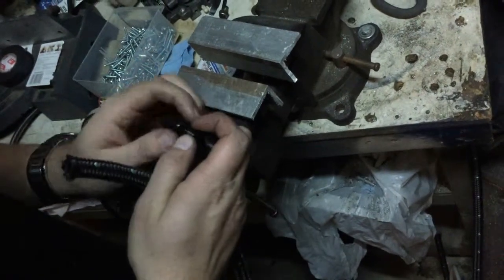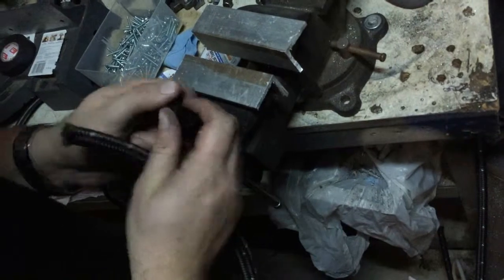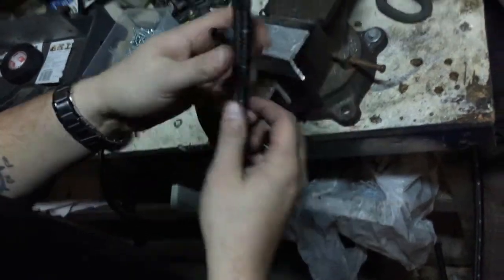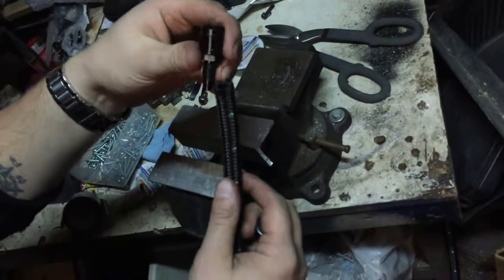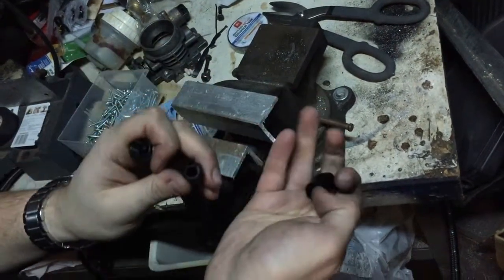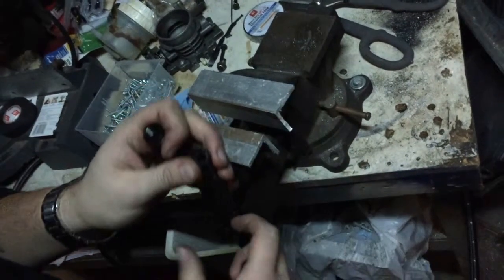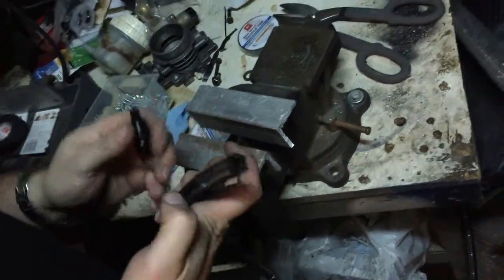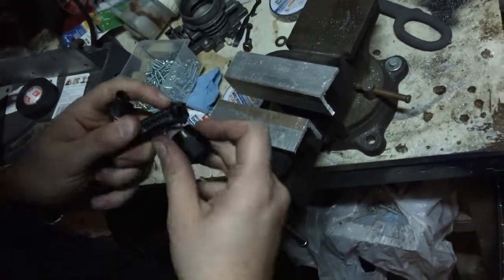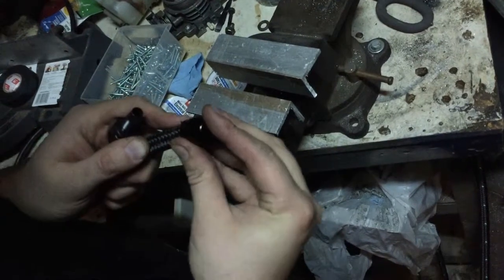These fittings are two pieces: there's a cap that slides over the end of the hose where we've cut, and another insert that tightens in. The compression of that shank pushing inside the hose expands it and compresses it against the walls of the cap. You start by sliding the cap onto the existing hose, and in a second I'm actually going to put that into the vise.